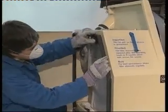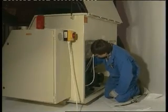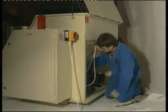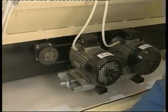Check door seals for a good all-around seal. With the rear panel removed, it's possible to check the drive belt for any cracks, damage, and correct tension. Belt tension can be gauged by twisting the belt sideways — any more than 45 degrees and an adjustment is required.